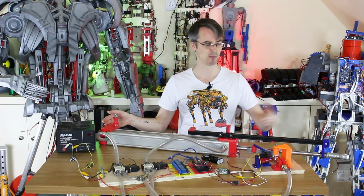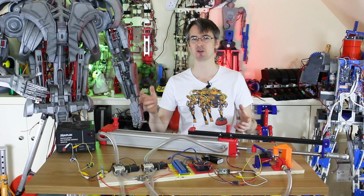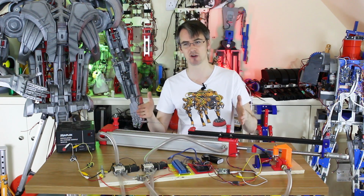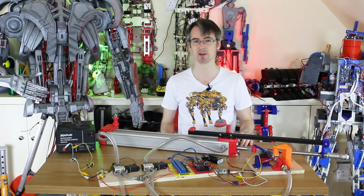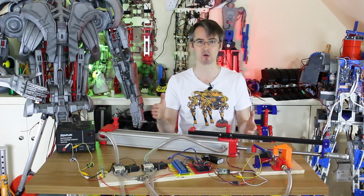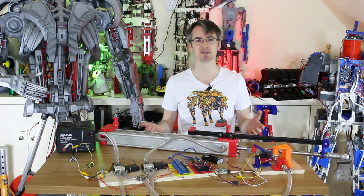I'd probably just rely on pushing it right to the end and have a hard end stop like we did in Transformers, which is how people normally use pneumatics. And the other solution, of course, would be to have the position control we had, and there's nothing wrong with having 2 air sources, 2 compressors with 2 regulators, so we always get identical pressures on each one. Could work quite well if we do need that sort of granular position control, but probably not proportional. So I hope you've enjoyed the R&D, that's the purpose of this video.